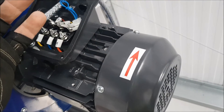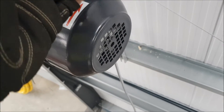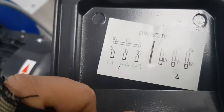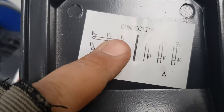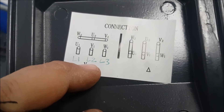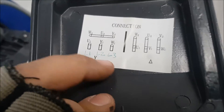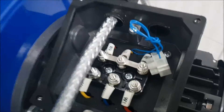I'm not sure if it's the same for VF drives. We're running this on just standard 415v three-phase, not on a VF drive. So if you haven't got a VF drive, these are your connections. Obviously don't put anything on top because you'll have a dead short across three phases. So U1 is your L1, V1 is your L2, and W1 is your L3. Most three-phase motors do not require a neutral.